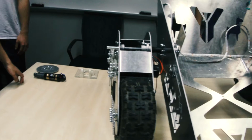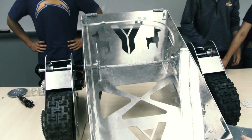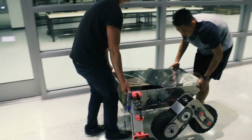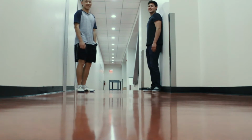The rover's chassis was water jet cut from 6061 T6 aluminum sheet metal, which was then welded together to house all of the rover's systems. In designing our rover, we took into consideration what it would take to drive a 50-kilogram rover up a 45-degree incline. Based on our calculations, we developed a drive system to meet and exceed these expectations. The resulting design, based on our rocker bogie drive system, has 4 contact points with the chassis, as opposed to the traditional 2-point system. The final iteration of our rover will have a differential gearbox bridging these 2 rocker components for a greater degree of control and stabilization.